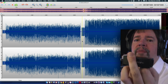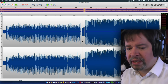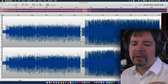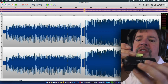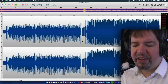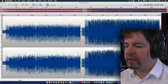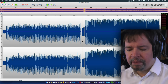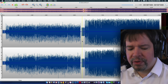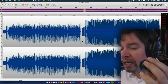If you have really small transformers, you might be able to build one into something like this. You could buy line isolators and stuff like this. If you take these guys apart, there's just a sort of H-pad of resistors in here, and there's a little space. It's not enough space to have a transformer that's this big. This one won't fit. The one that I used might possibly fit, and if you find even smaller ones, the action, probably the frequencies of the infundibulator will go up in frequency, and it'll be voiced a little higher, and will probably engage a little quicker at lower volume levels, and might possibly fit into a pad box like this. So it's really kind of up to you.